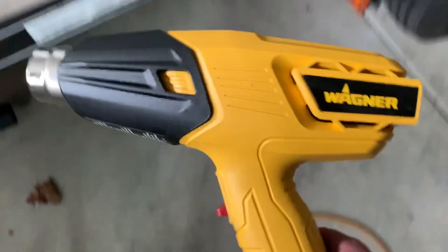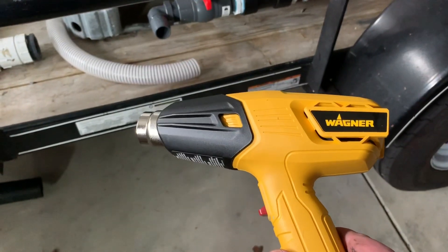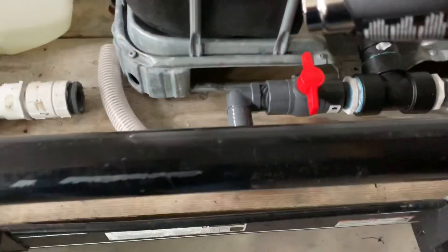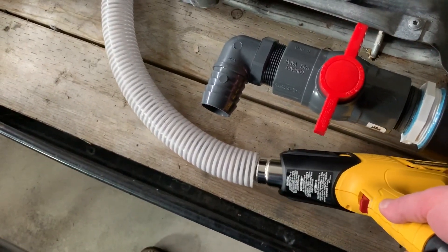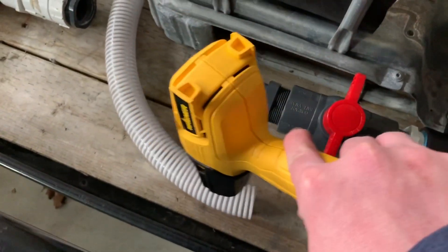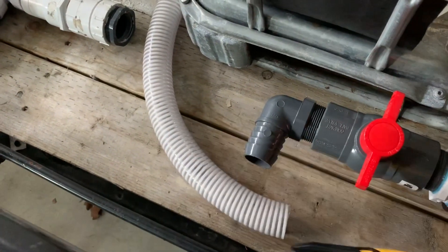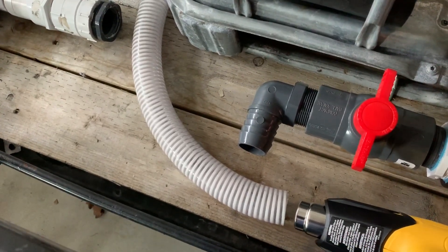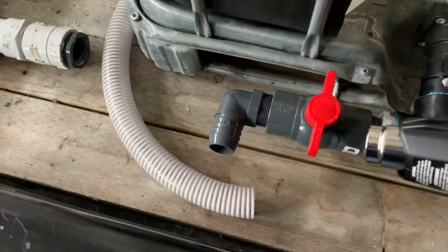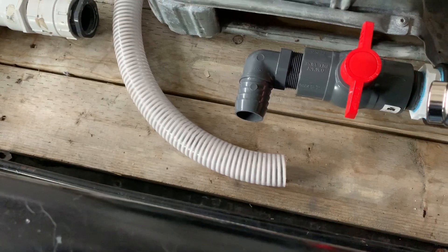Just another tip guys — if you are going to be doing some plumbing, pick up one of these: a heat gun. There's better ones out there, this is just a Wagner, I picked it up from Lowe's for $22. What I did is I just heated it up straight on — just kind of go around in circles, because a lot of times this lip right here isn't going to heat up as much as if you're going down on your tubing. Put a little soap in there on the nozzle that you're going to be connecting it to, heat this up real good and it will slide right on there. Another way if you guys don't have a heat gun — get a thing of boiling water, and then just kind of put your tubing, the end of it, in a pot of boiling water, and then it will also just slide right on there.